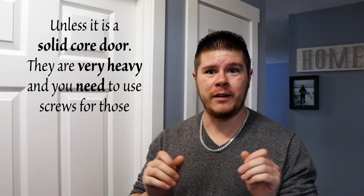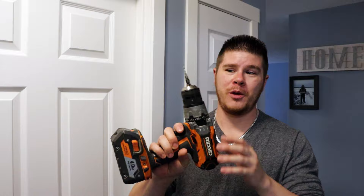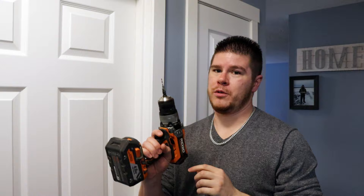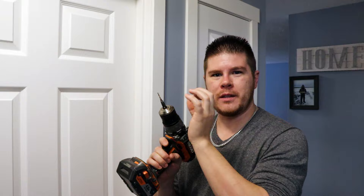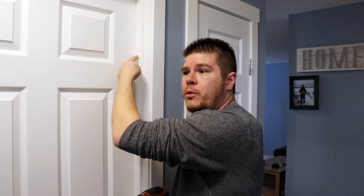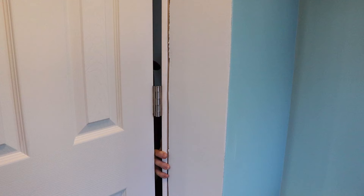Now, I know a lot of people are going to be yelling at me saying I just installed a door frame with an 18-gauge brad nailer and some 2-inch nails — that's not going to be strong enough. Trust me, it is. Alternatively, if you don't have a brad nailer, you can use a drill with a countersink drill bit and drill through the door stop. Countersink the head just enough so the screw will be buried, then take at least a two-and-a-half-inch deck screw and drive it through the door stop, through the shims, and just get it tight enough that it snugs up. Don't over-torque it trying to blow the door jamb through the two-by-four — it just has to be snug.